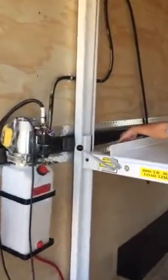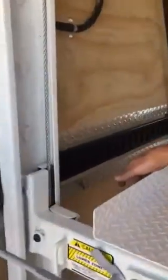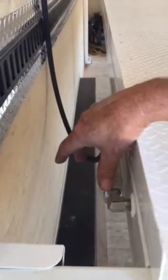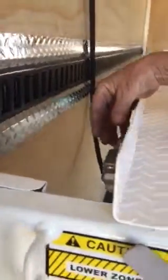Right over here, where my finger is, is a flow control valve. On these new lifts, we've moved the flow control valves to the outside so you can monitor the downward speed. The more weight you put on, the faster they'll come down. You just turn it clockwise all the way — it would shut it off completely. Counterclockwise would start letting fluid come back and control the speed. It's a flow control valve.